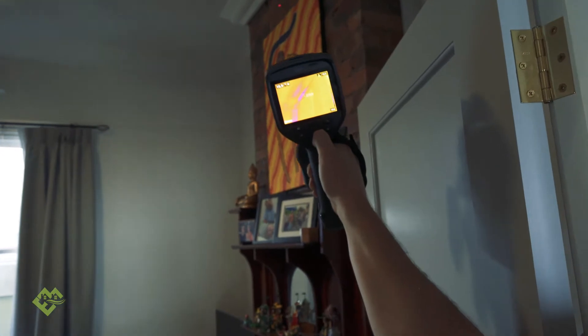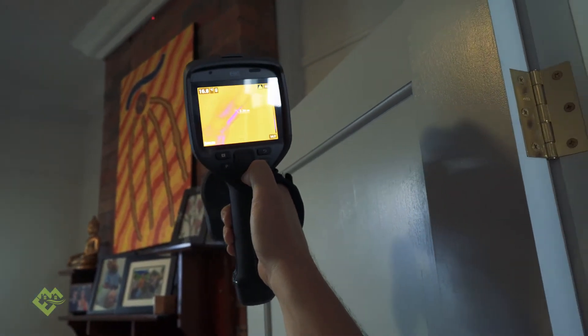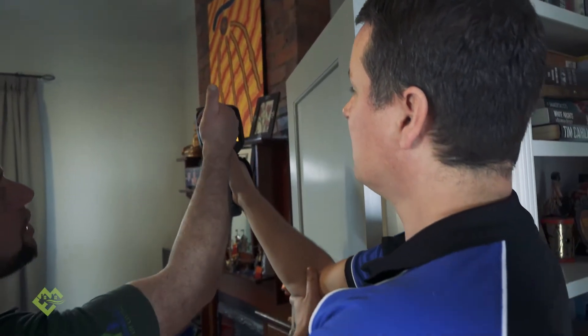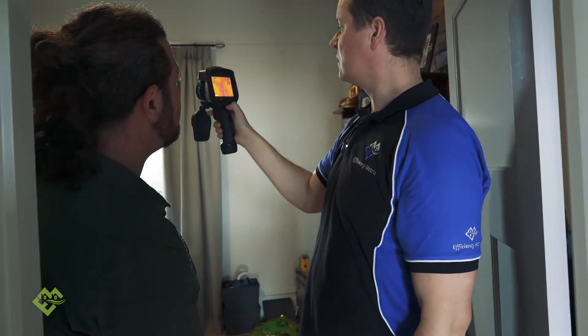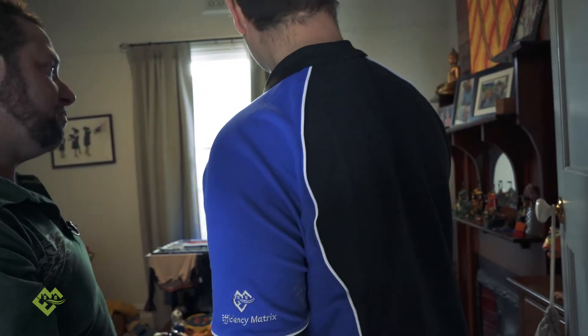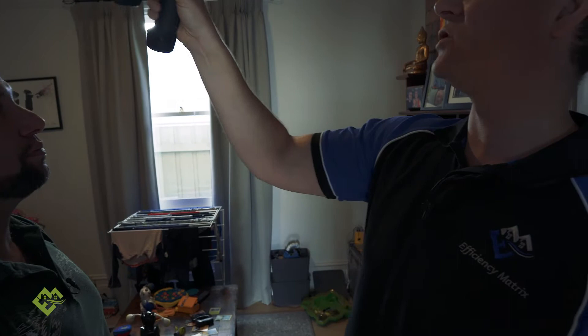You've got a pretty decent air leak just here though. That's the old chimney, just on top, and in this corner. But your insulation install is really good — just in those corners. We're missing some insulation where you've got walls coming off the facade. But all your ceiling insulation looks fantastic — you've done a great job.